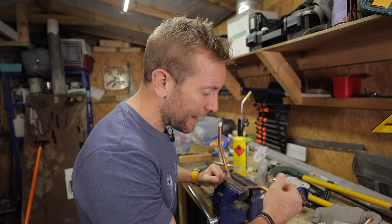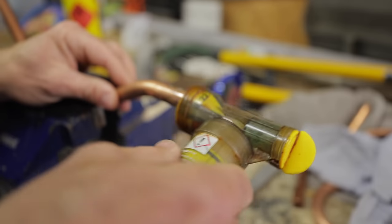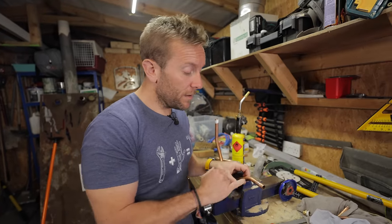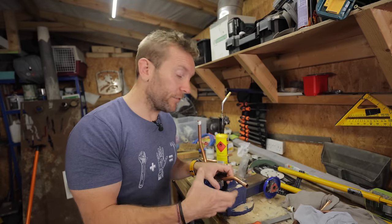We need the pipe to be even cleaner, and the way we do that is we use acid flux. Believe me, don't get flux in your eye — I got it in my eye once and my apprentice laughed. I was not happy with him. Just get some flux on there like so. Do not get flux on the inside of the pipe, because flux is an acid and it can stay in the pipe, and over years can burn through it and cause a pinhole. But when we do our flaming on here, we heat it up so much it burns off after the soldering is done.